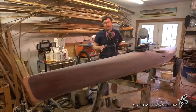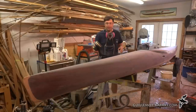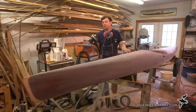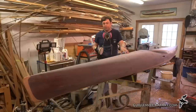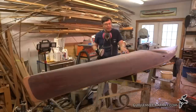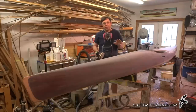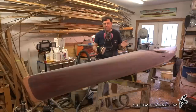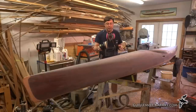With the long boarding done we can break out the power tools. I've got my Festool — the smaller one that does a finer orbit, 3mm orbit. The goal at this stage is to just get rid of the scratches from the fairing. I used 80 grit there and I'm going to use 100 grit here as a compromise between speed and fine finish. Going from 80 grit I could go directly to 120, which would leave a finer finish but take longer. Since hand sanding tends to make deeper grooves than the random orbital, 100 grit will be a bit faster. From there I might go to 150 and then 220. I'll go one step at a time, but this should go quicker with the power tools.